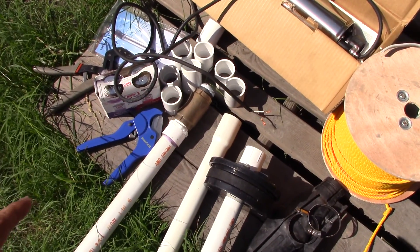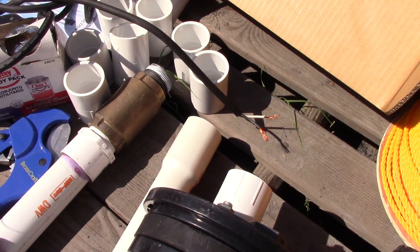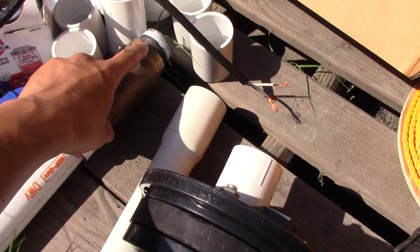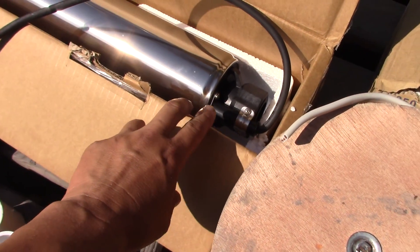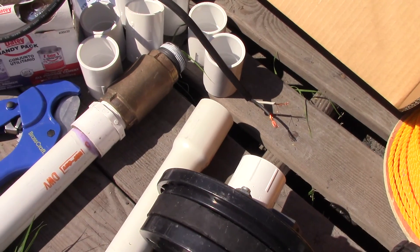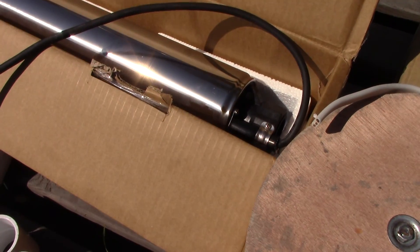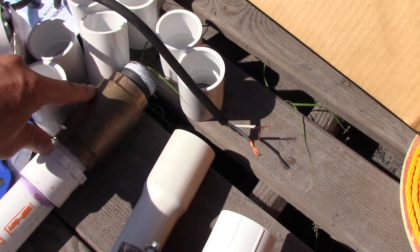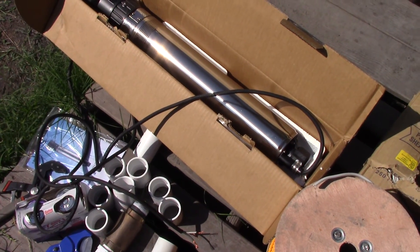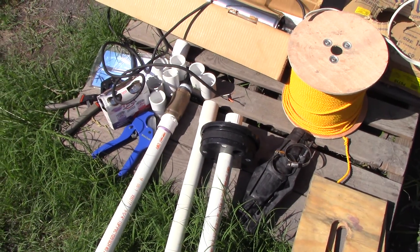And finally at the bottom here, the connection is going to be made using a male end to my brass check valve. The water is going to go this way. The male to male PVC connection is going to go into the pipe right here, so the water is going to flow from there, be pushed into here and go up. Now the pump itself has a check valve built in, but I don't quite trust a plastic check valve. So I decided to go ahead and purchase this brass one, just to make sure that the motor in the long run won't fail, because a column of water isn't going to be hitting it every time it stops.